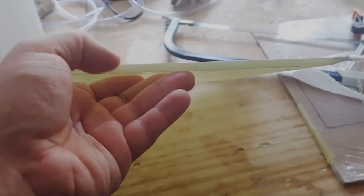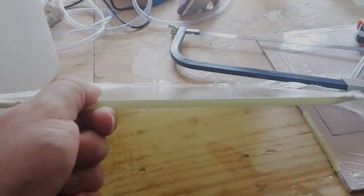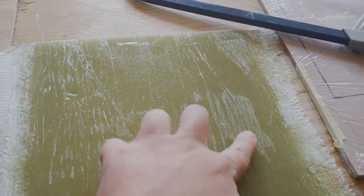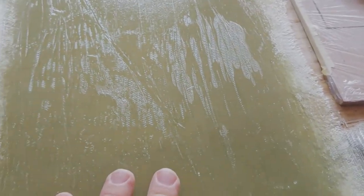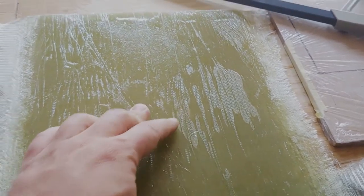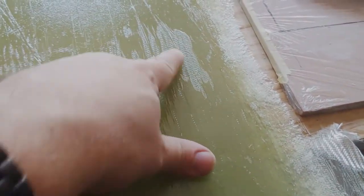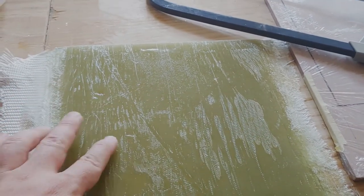Only because our fabric is a little bit lighter than the US stuff, and if we do more than a certain amount of plies it becomes significant, so we add some more. But this is solid. The surface didn't come out quite as I wanted. There's a divot in it. Putting the pallet wrap over it, as the plan calls out, has caused it not to look great. It does look like trapped epoxy between the cling film and the fiberglass. Here we see just bare fiberglass. The surface doesn't look great.